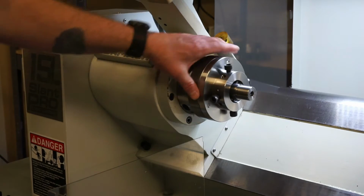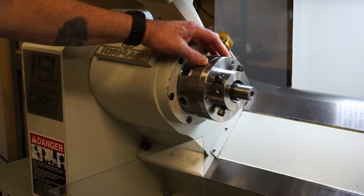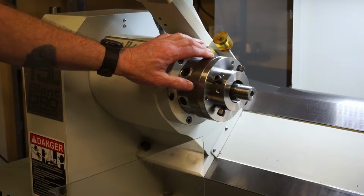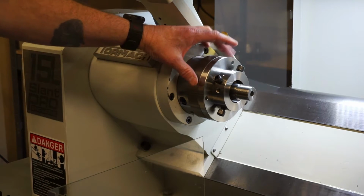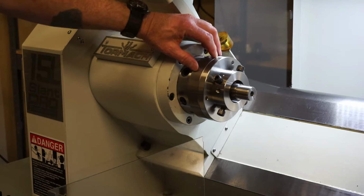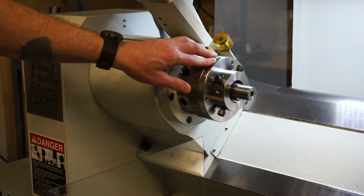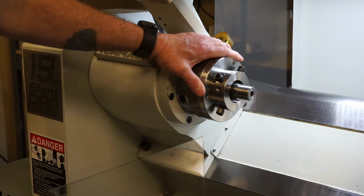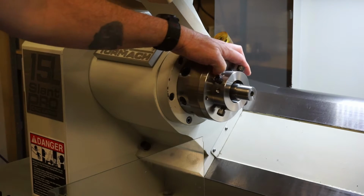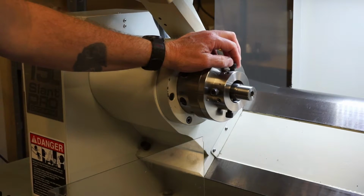Okay, we're into the inboard spider assembly right here. Basically it's two parts, a D14 back plate and a piece of stainless that I turned. There's a small flange on the outside of the back plate right here, and I've got a pocket in there and slip the two together. It's a very, very tight fit, doesn't go anyplace. Standard 4-point brass tip screws on the spider.